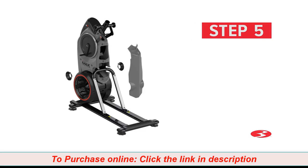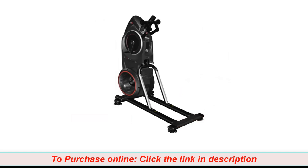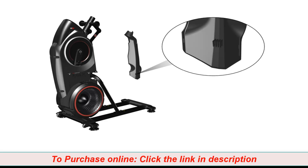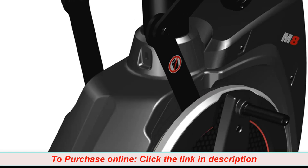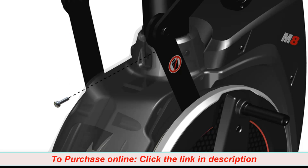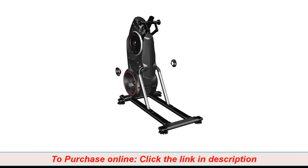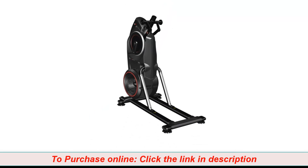Step 5: Attaching the rear shroud. For this step, you will require the following part. Begin step 5 by attaching the rear shroud, part number 2, onto the frame assembly. To attach the rear shroud, place the inside hook of the rear shroud on the frame assembly and then pivot it up into place. Use one part F screw to secure the shroud. Place the screw on the top hole as shown and tighten the screw using a Phillips screwdriver. Next, attach two part number 17 caps on each side of the frame assembly. Gently push each cap into position. Step 5 is now complete.